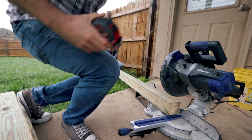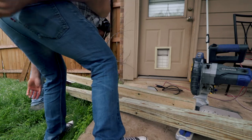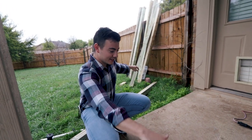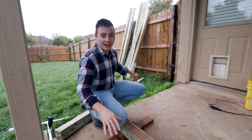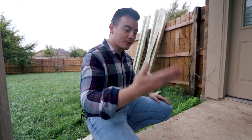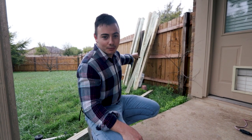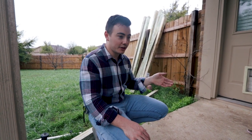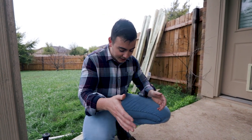Let's double-check the length. It's a little bit short. Mistakes were made. When we had it over there, this end was at a higher elevation than over there. So when Kyle thought he had it pushed down, it really wasn't all the way down — that's why we got that cockeyed cut. Luckily, we're going to take that messed-up one and cut it into two of the pieces we need: the 43 and 41 inch, because it's 84. So now we got two planks.